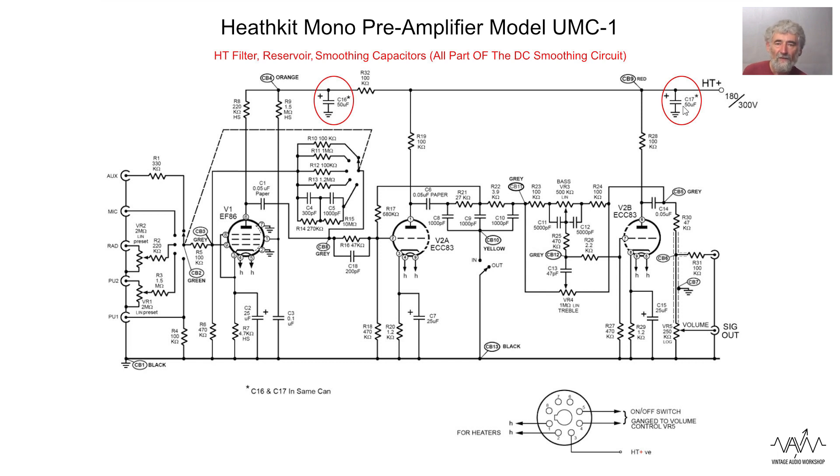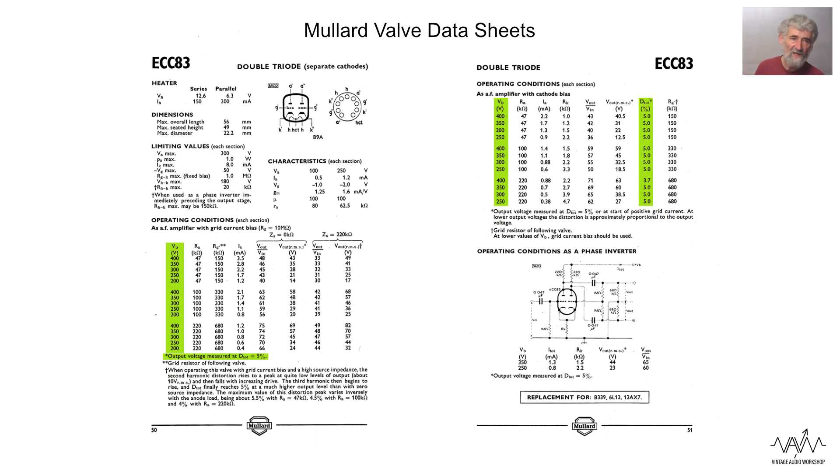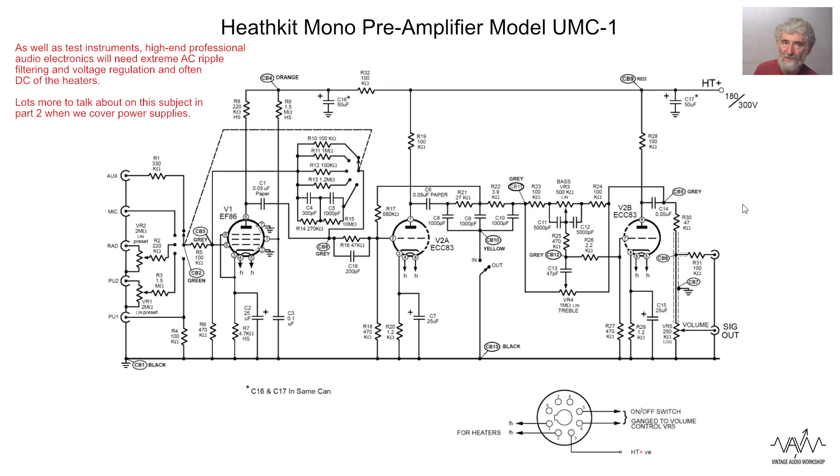The only thing would be that the maximum output level before it distorted would be reduced. But this is probably used to drive a power amplifier with an input requirement well below 1 volt RMS. I suspect that with 180 volts - never mind 300 of HT - it will give 10 volts RMS output without distortion. If you greatly limit the undistorted output by reducing the HT, it wouldn't matter because your power amp doesn't need the big swing anyway. Most valve circuits will work with a wide range of voltage, though there are exceptions - in audio generally it isn't that important.